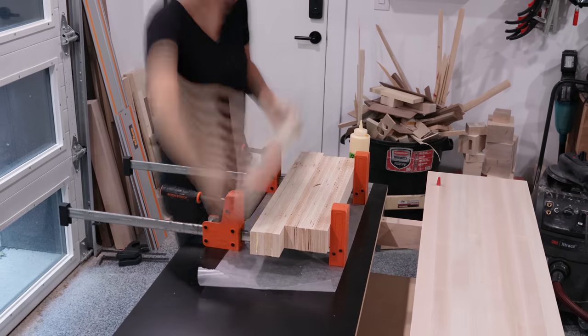Now for the dog holes. This template is really easy to use and it has exactly what you need etched right on the jig — a 3/8-inch outer diameter bushing with a quarter-inch straight bit. My six-in-one jig has a recess meant to be used with a guide bushing; it locks right into place and is ready to use. A guide bushing basically turns any router bit into a pattern bit. I already know exactly where the first hole will go from laying out the spacing for the wide inner supports on the torsion box, so all I need to do is make one mark and line up the jig using the etched center lines and included bolts.